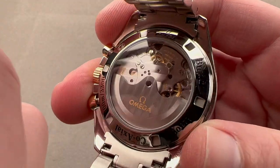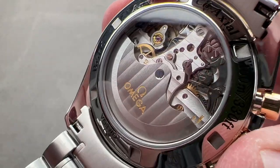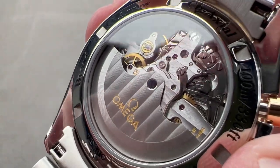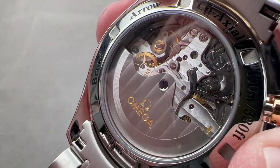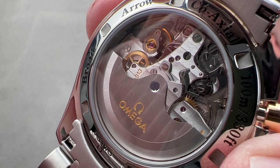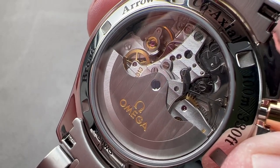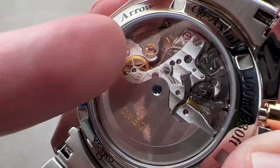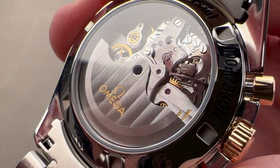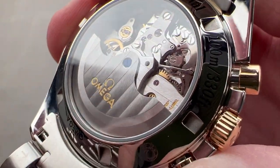When we flip it over, we can see a little bit of a glimpse of haute horlogerie, as we have a Frédéric Piguet-based movement — Frédéric Piguet is manufactured by Blancpain. You can see reference 3313, based on the Frédéric Piguet 1285, essentially a thicker, more durable version of the 1185. Lots of upgrades here: it gets an Omega coaxial escapement for greater precision, improved endurance between services, and improved power reserve. Power reserve is 52 hours automatic winding. We have a five-position-adjusted free-sprung balance, better to help this watch earn a COSC Swiss chronometer certification on top of the coaxial escapement. You can see we've got a column wheel — that's a feature you will not find on a standard Moonwatch, which uses a cam.